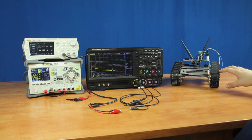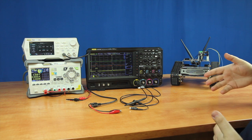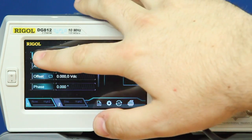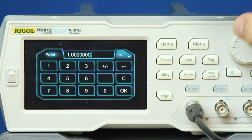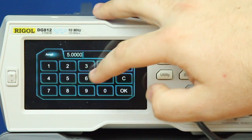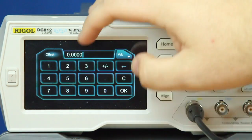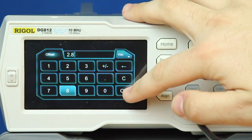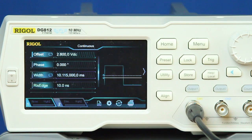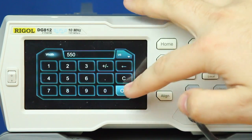Due to the battery capacity of our robot and ease of use, I have elected to use our waveform generator to recreate these signals, since it will allow us to create a repeatable signal we can readily change. To create this signal I am going to go into our pulse menu, change it to period, and set our period to 20.23 milliseconds. I am going to set our amplitude to 5.6 volts, and since the signal goes from 0 to 5.6 volts I will set the offset to 2.8 volts. Then I will go down to the duty cycle, change that to width, and set the width to 550 microseconds — its narrowest value.